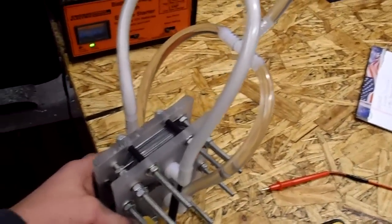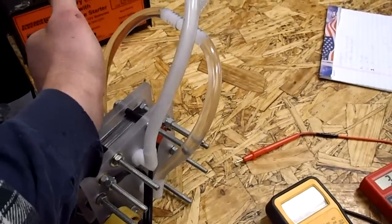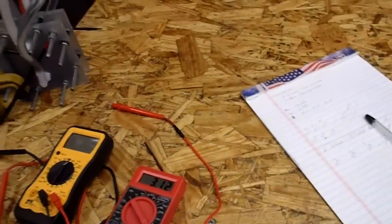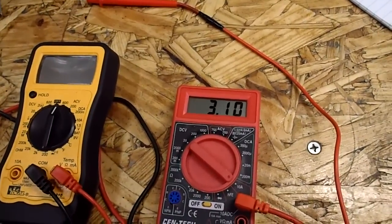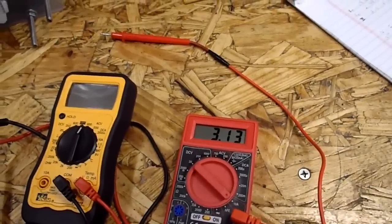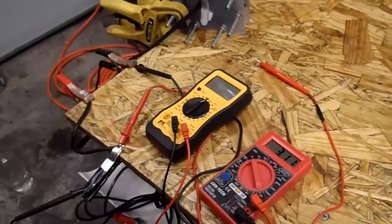Okay, probably the last clip for tonight. Right now I'm just trying to get some heat going, see what this can take, and it's just room temperature. Room temperature at best, and it's been running for a couple hours here. I doubled the baking soda in there, so 8 tablespoons, and I've gotten it up to just over 3.10 right now. I've seen it up to 3.25, about as high as I've seen it. So it increased the current flow, and brought the total voltage down to around 17.4, I think, volts across the cell.